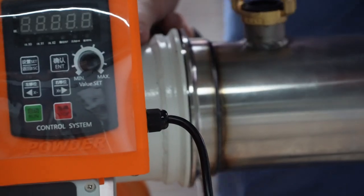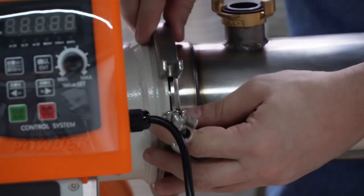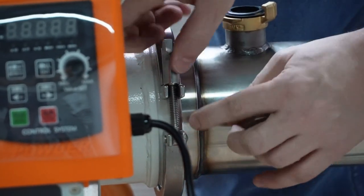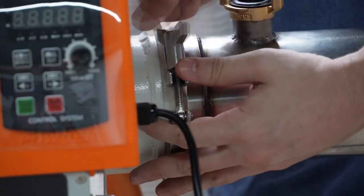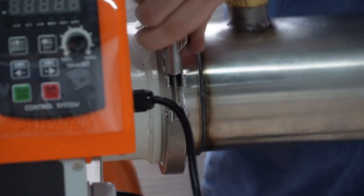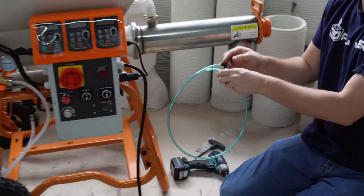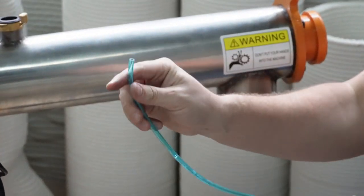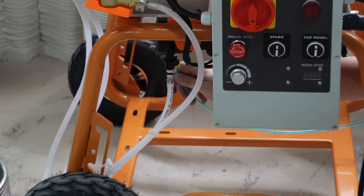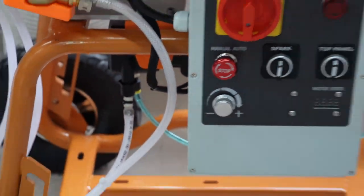When putting on and tightening the securing clamp, make sure that there is no gap. You can continue to make small movements with the mixing chamber while tightening the clamp to make sure of this. The last assembly step is to attach the water pump output, which can easily be done by sliding the water hose into the output of the water pump. The machine is now fully assembled and ready for use.